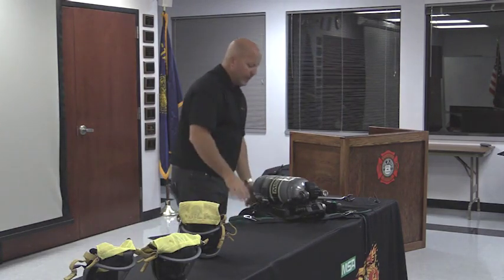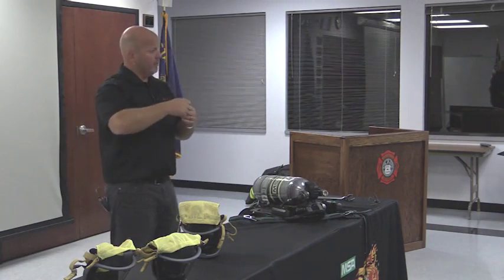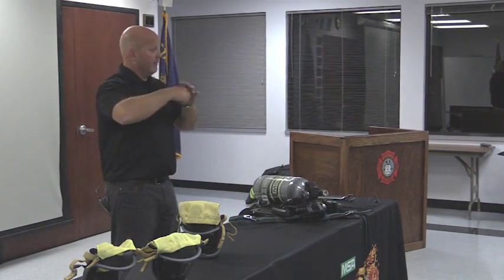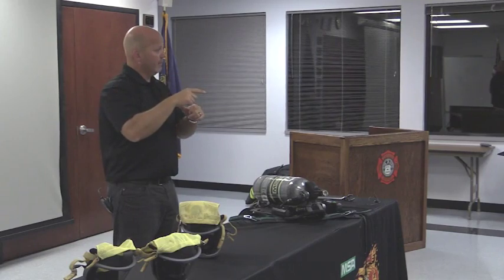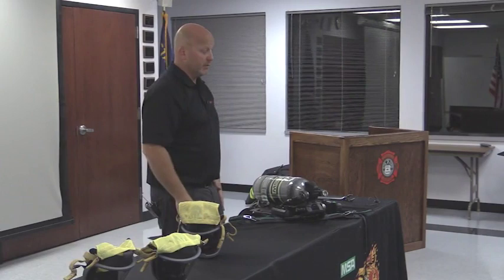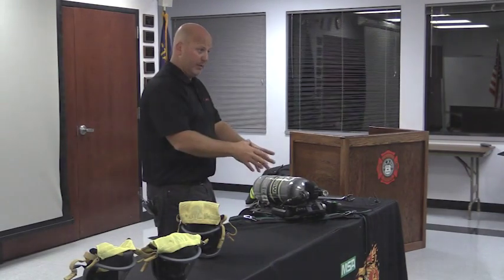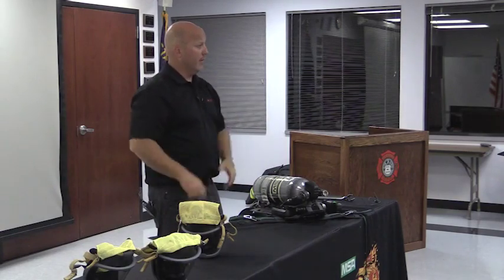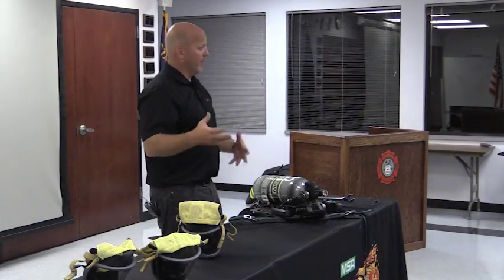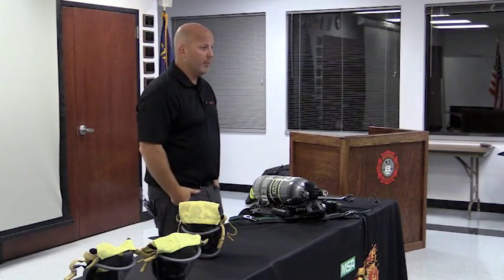Okay? The truck packs, really no different, other than I would open up that hose, make sure it's there, the dust covers are on it, and put it back in. Okay, so really no function difference other than a visual function difference. We already talked about the mask: your cleaner, 5-gallon bucket, completely submerged, rinse it, and you're set to go. Air dry. Don't put, obviously, a wet mask back into an airtight compartment. It'll be green when you go to pull it out the next time.